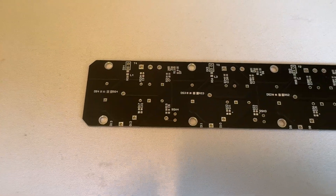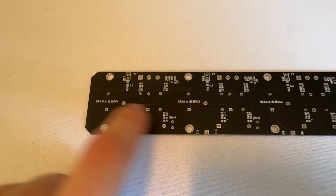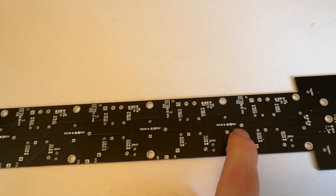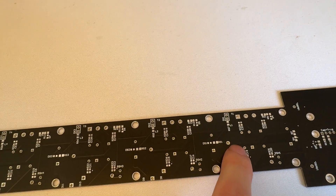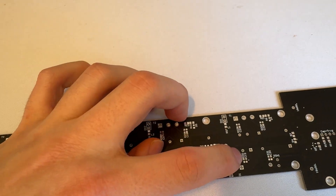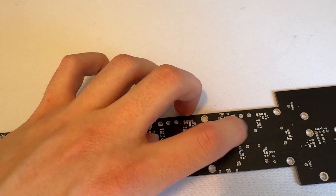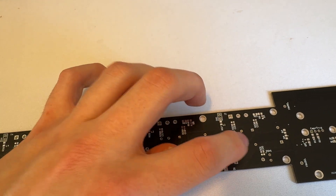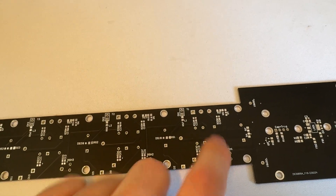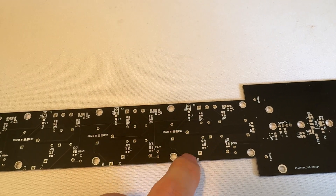You can see the most important parts — here for the SCR, and more LEDs here, here, and here for each stage to see when they're charged. The connectors for the coils: I made one here and one here, and for backup, another one here and another one here — so I don't have to worry about winding direction. Then of course some resistors, more diodes, and the big diodes from here to here.